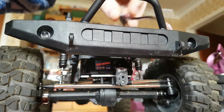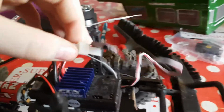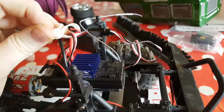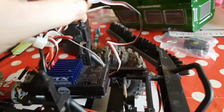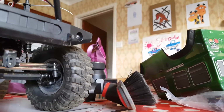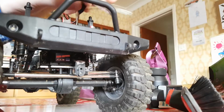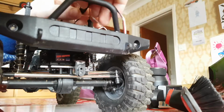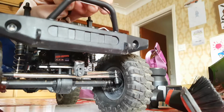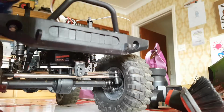So the first thing you want to do is unplug the servo. Just up here, in all these leads, there's this plug. You have to unclip the tape cable tie. I've already done that. And then there's this plug. This is hard with one hand, so I'll put you back. You very gently pull it out, like so.